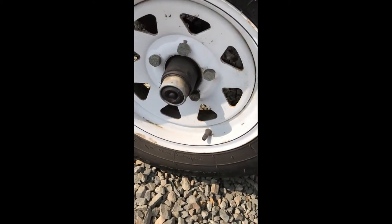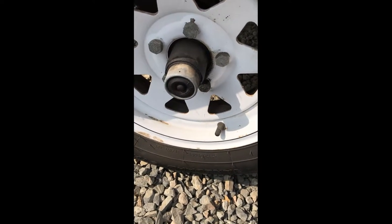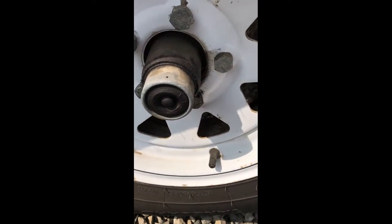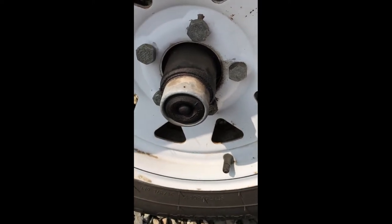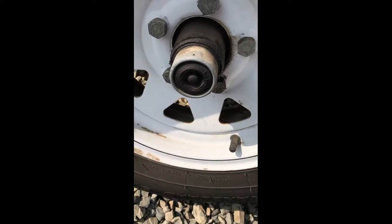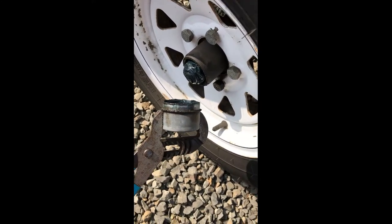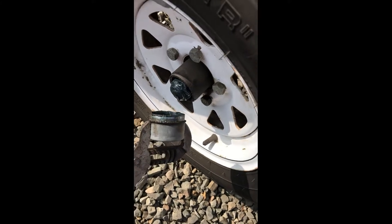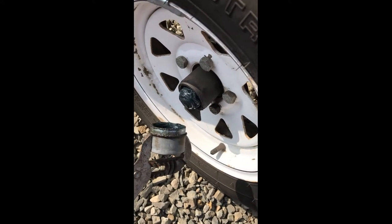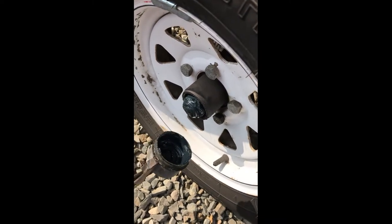Here's the other side. It may be a little clearer to see with the sun shining on it, but this grease cap isn't in as bad — you can see right down in there that it's starting to crack. I guess they only have a certain life, especially when they're exposed to petroleum products. This one came off pretty easy with the channel locks just rocking it back and forth. You can see this grease in here is a lot dirtier than the other — it's probably had exposure to water and dust. So I'll have to really grease these once I get back out of here.